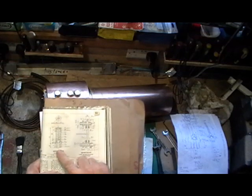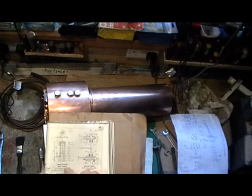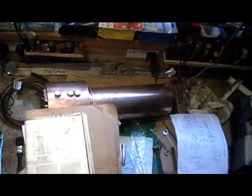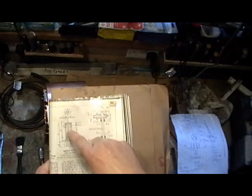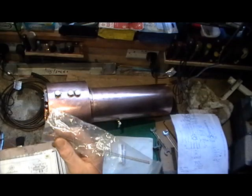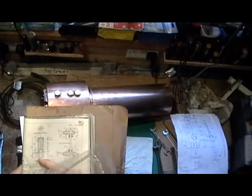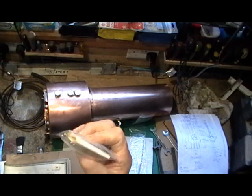Here's the drawing for the safety valves and I don't think I'm going to show you me actually turning it because I'm not doing a turning exercise as such. I'm just explaining what the fittings are that I'm making and how I'm doing them and where they fit. I've decided to make these two safety valves for my next little job. The reason for that is my springs just came from China — it's a stainless steel 304 stainless spring, which I shall be using in the valve that sits on a quarter inch stainless steel ball.